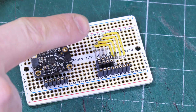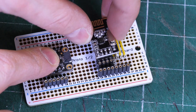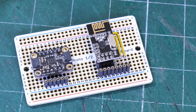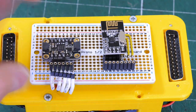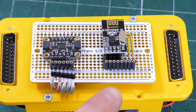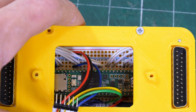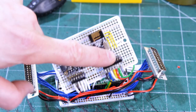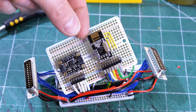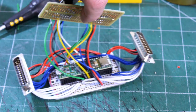Let's do some soldering. A bit of creative wiring on my perma proto board here. Here's my NRF24L01 that plugs in there and breaks out the pins to this piece of pin strip, so it fits on top of my box where it was before. We've got one connector here for the I2C for the inertial measurement unit, and we just need another wire that takes SPI to our Teensy to connect up the remote device. I've wired those connectors in and put clear heat shrink on these solder terminals — the other one is white heat shrink — and all that's wired in for the SPI.